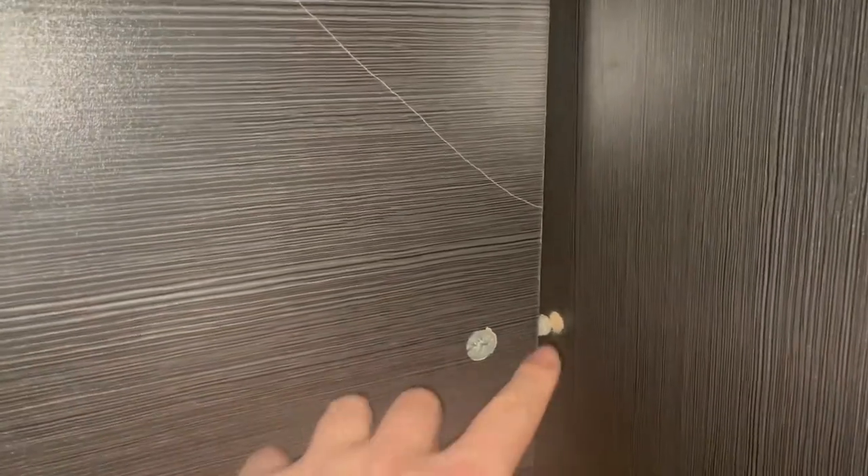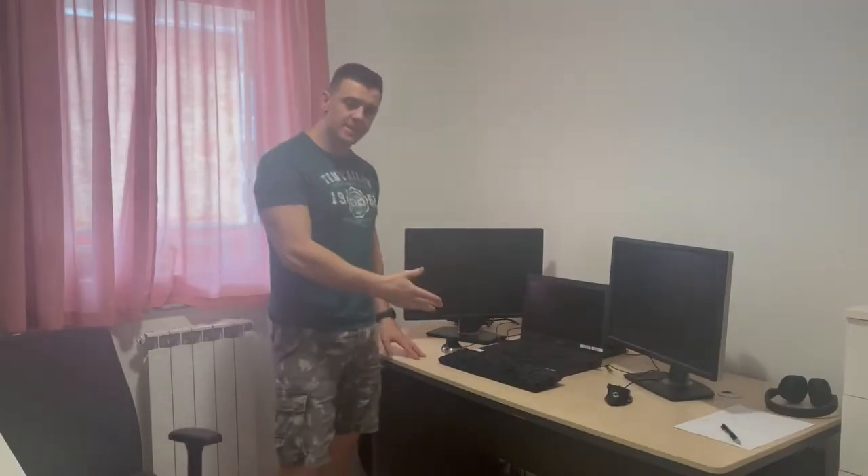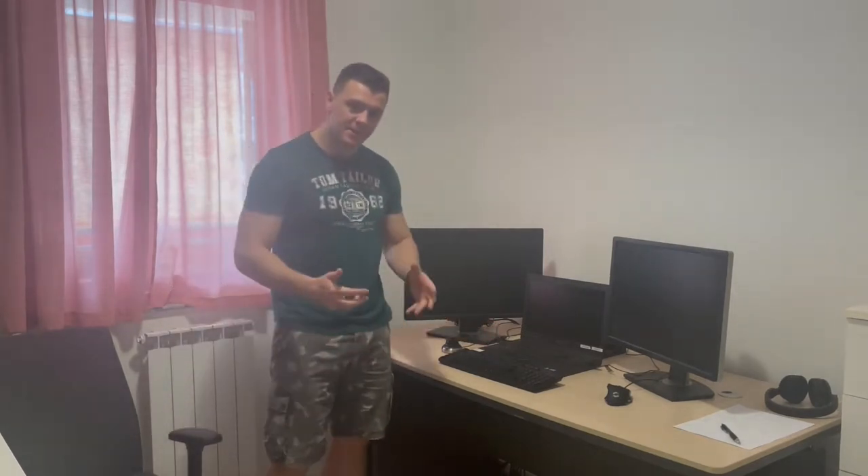The problem is right here with these fasteners — they move a lot and they come out from their holes. We want to fix basically this board to this side frame by using another piece of wood, and we're gonna fix it in this corner so it will be stable. Now we have two possibilities: we can try to fix this table as it is, just add the corners to the sides, but I'm not sure how stable it will get or how effective it will be when it stands on its feet.